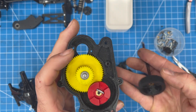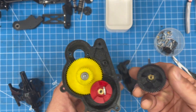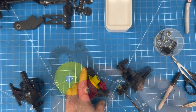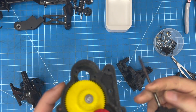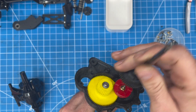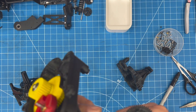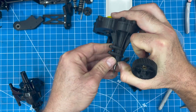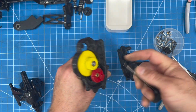In my case, I'm not running a differential — I'm running a locker, so there are no planetary gears. It looks like this thing kind of fell apart, probably during the Sunday runs. I think the pin was just floating in there. The pin keeps things in place, but it actually doesn't have a lot of functionality because once you put the cross pins in your axle, your drive shafts can't move inside anyway. So I'd probably leave it out going forward.